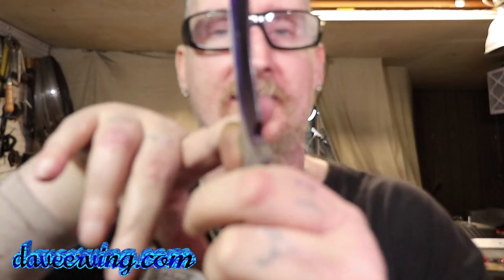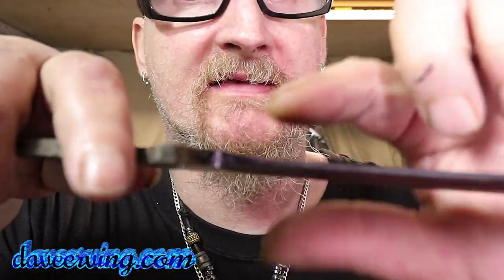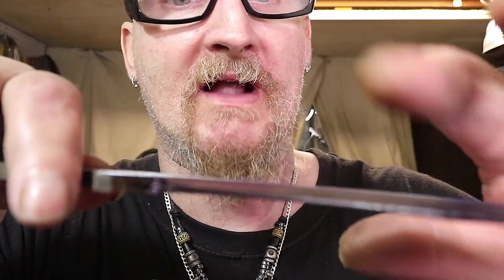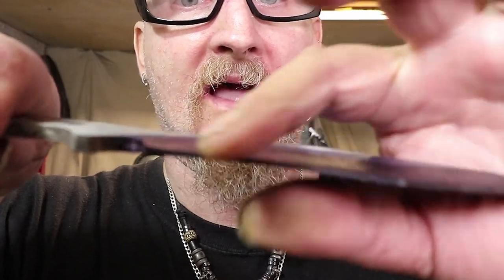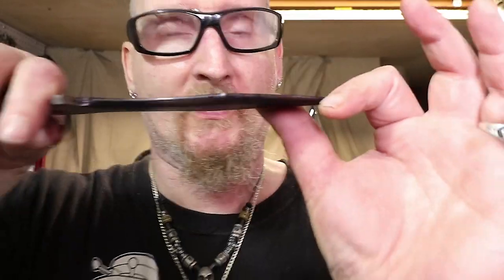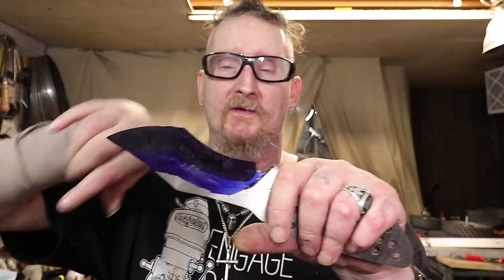Here's exactly what I was talking about — since I had to surface grind one side more, instead of the center line being in center, it's almost right here. We almost ran out of room and I have to take a bunch off of this side. This side's got about a 16th to go and that's all the way up. That's what I'm talking about — leave your center line thick or you're going to make it smaller and smaller to compensate.